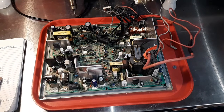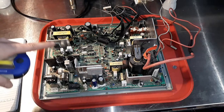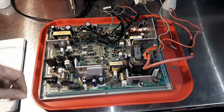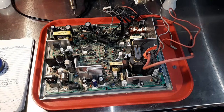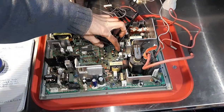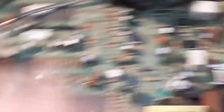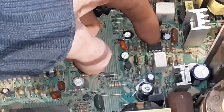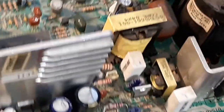I got all my parts in for testing the high voltage shutdown area. Some chips I wasn't able to test because I don't have an IC tester yet, but they're cheap parts so I just went ahead and changed them anyway. One of them is IC401 — let me zoom in — it's this little chip right here with four legs on each side, and that is a UC3842N or AN, whatever you can get closest to that. The other two parts are back here in the corner.